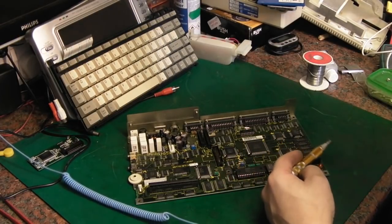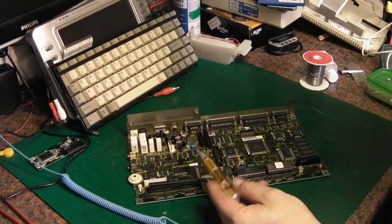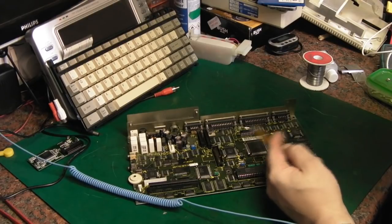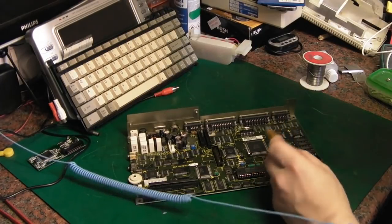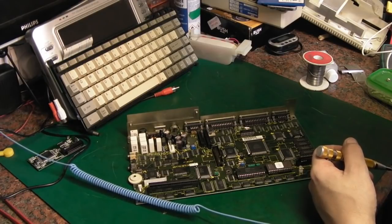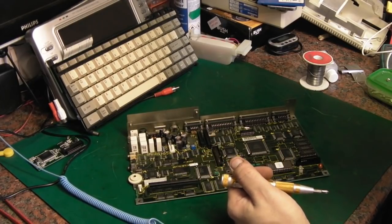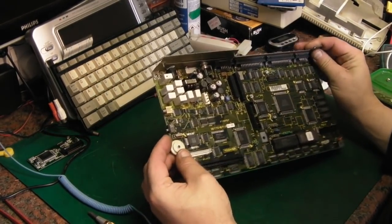What's really weird is everything seems to be surface mount, and then for some bizarre reason right here we have a Toshiba TC8521P in a through-hole package. Could that be a clock generator IC where there wasn't a surface mount equivalent at the time? That's a possibility. It's a nicely laid out, nicely presented board. Let's have a look at doing these capacitors.